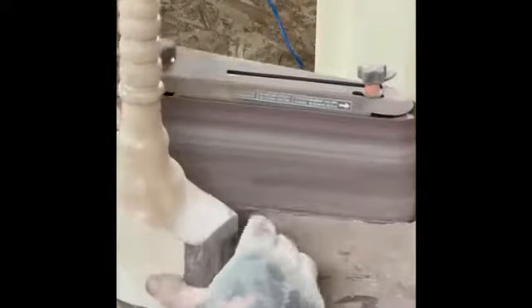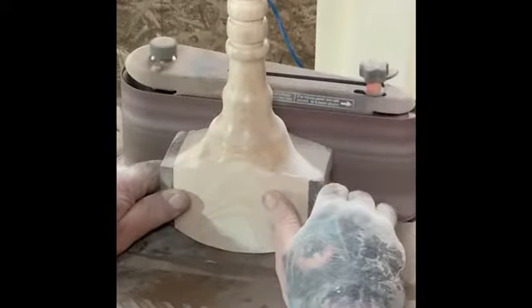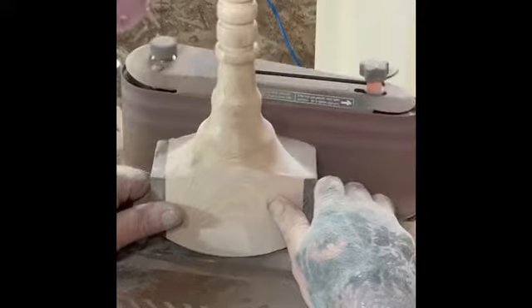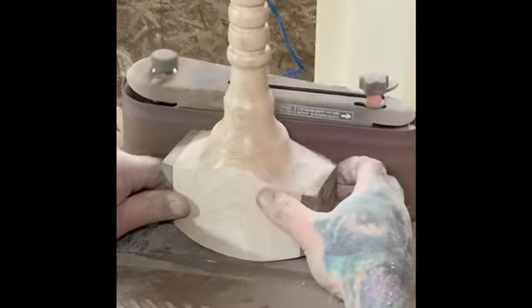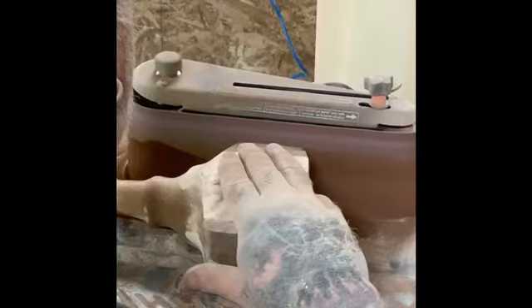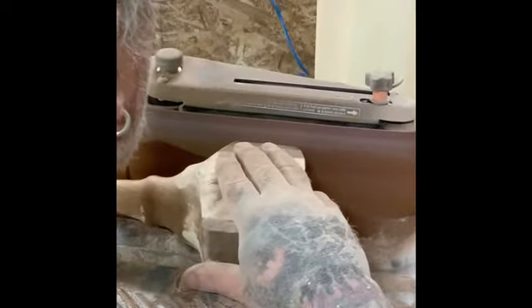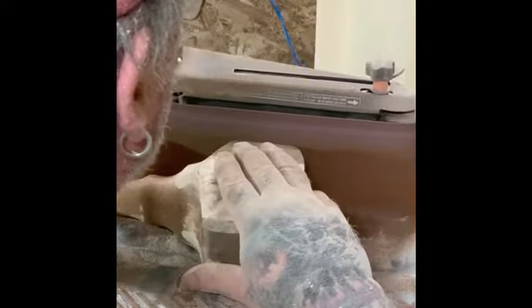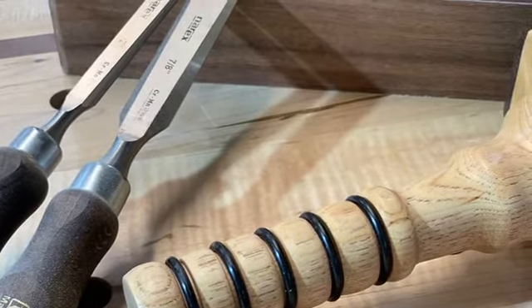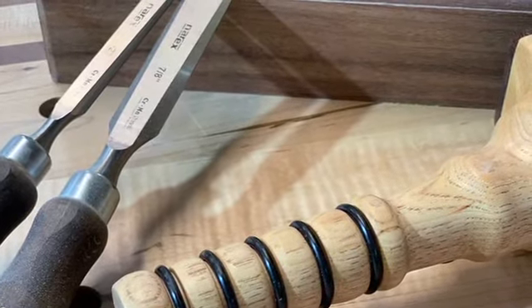The next step is to shape the rest of this off the lathe. If you have a spindle sander like this, it'll make short work of it and make it a fairly simple process. The secret to keeping all your sides even and true is to keep your handle pointing straight up — everything will be nice, straight, and square. When finished shaping, surface sand to around 600-grit and apply a light coat of antique or tung oil, which I find works great. You'll be left with a beautiful heirloom piece that'll last for years of reliable service.